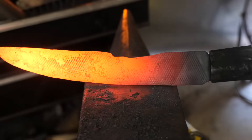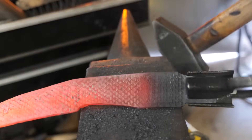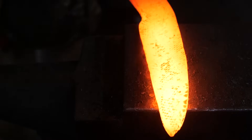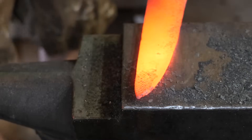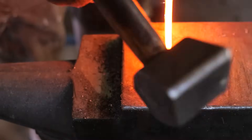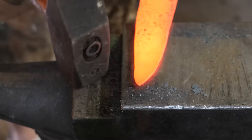That's not to say they don't make a good knife steel. I think that's just one more reason you wouldn't forge these under most cases — you would want to preserve the checkering or the file pattern by doing stock removal, then just temper it down without bothering with heat treating. I haven't done a whole lot of forging in the last couple of years to be honest.